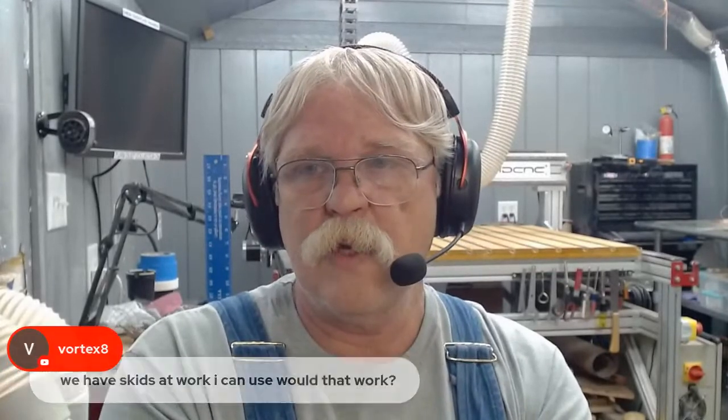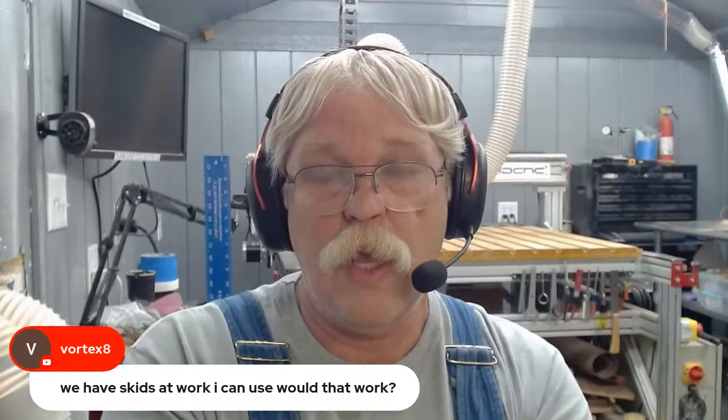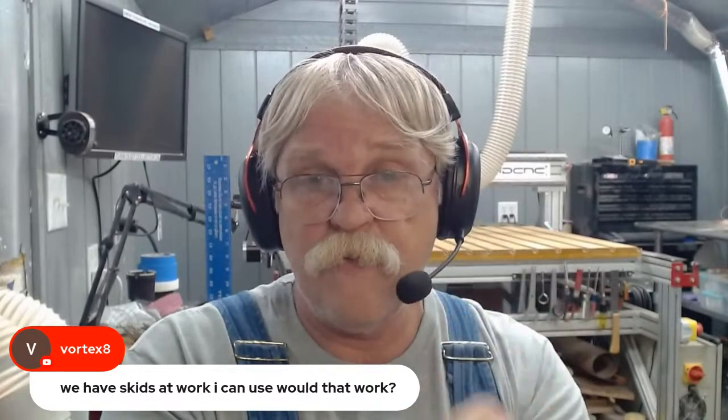Now I see Vortex 8 saying we have skids at work I can use. Would that work? It might, but be very, very careful, because those things they've not been taken care of. They're not designed to be taken care of. So they have rocks. I mean, they get dropped and scooted around on concrete or out in a gravel driveway. They have rocks, and that'll tear up a tool real quick. They have nails, they have staples, they have all kinds of stuff in them. You might want to look for clearer material.